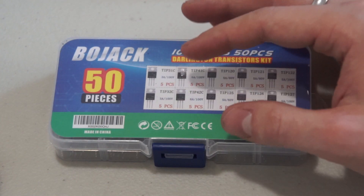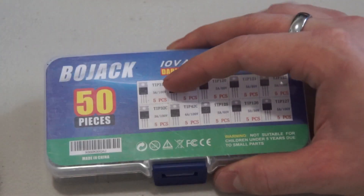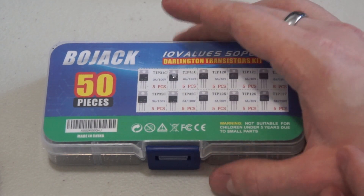But the next problem is that it's a 0.8V signal and the Arduino can't read 0.8V — it needs like 3–5V in order to trigger. This brought me into a deep rabbit hole of circuit design, and this is where things got hard for me. All I needed was to convert that 0.8V to 5V, but circuit design is not my specialty.